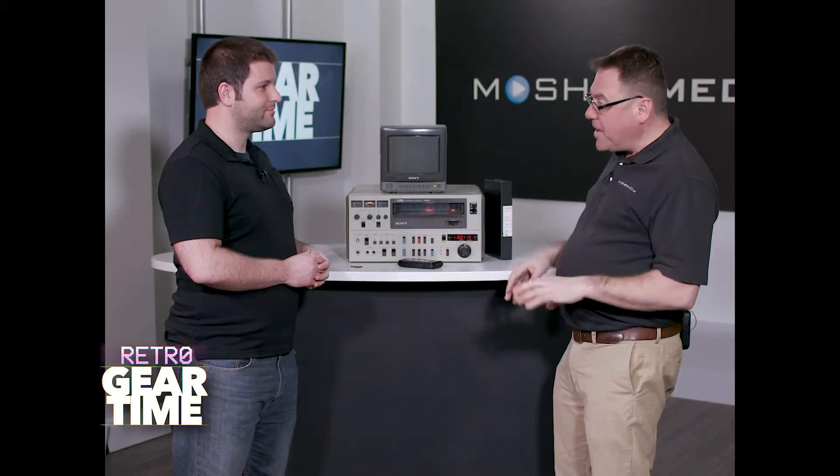It is probably the last Sony RM450 and 9800 series U-Matic player, and they are still using it to edit programs that air on that station. With that setup, you're only doing linear editing — you make a cut and you're stuck with it. You're committed. You cannot go back and change anything without erasing over it, and you can't shorten anything. It's like building a brick wall: you can't take the brick out at the base. You're done.